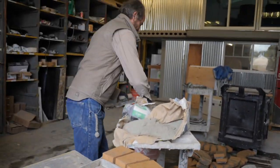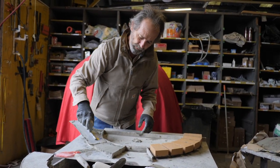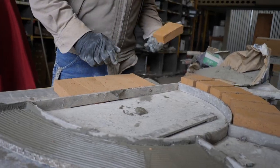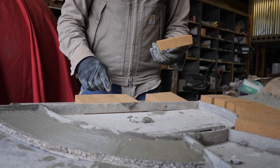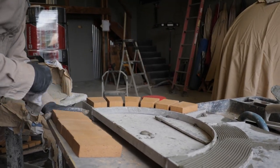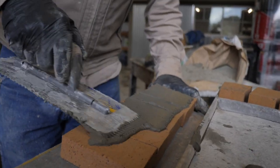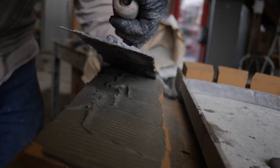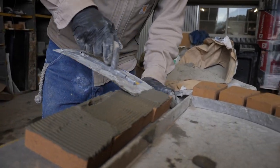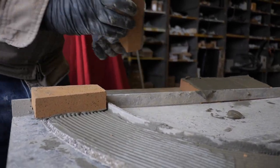So right now we're making the faces. You want to work this stuff into the cement board so it gets a good seal. Get the best side and put that face down — usually both sides are pretty good. You want to get an even amount of thinset. Push them in there, just slightly push down till it squeezes out — it's a nice little section.